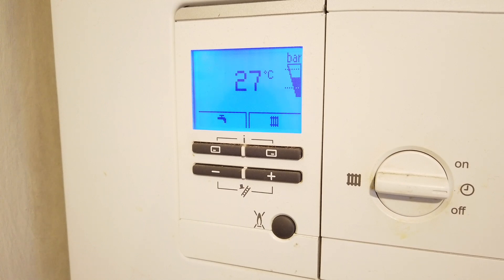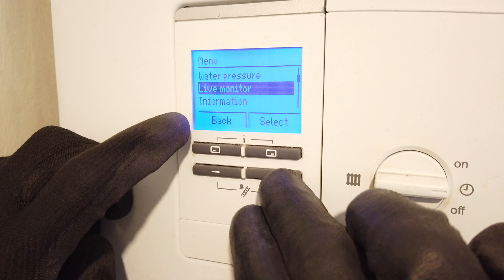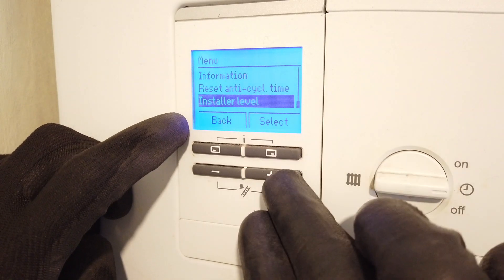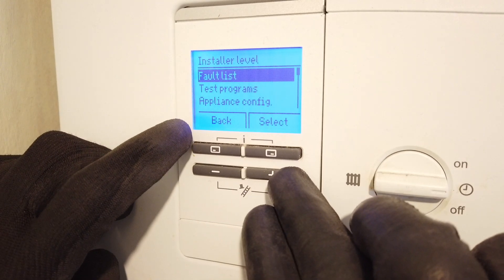The reason for this is that after a power cut, it ends up in a reduced power level state and appears not to ever reach maximum flame mode. You will need to enter the service menu and use the plus and minus buttons to change to the engineer code as shown on the screen and press OK to continue further.